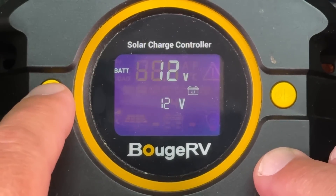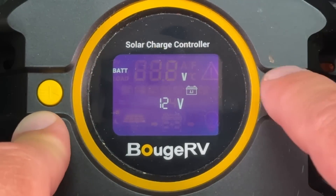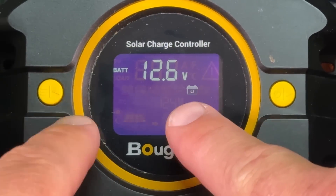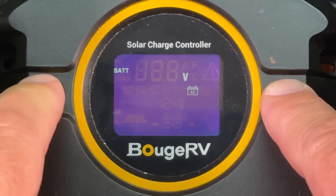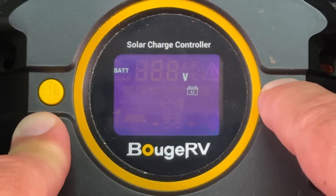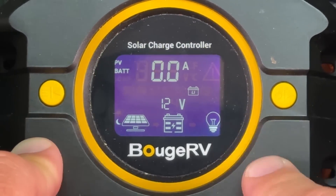Let's click the left button again — notice it's on 12 volts. If we long press the left button, that'll start blinking and we can change it to either a 12-volt or 24-volt system. We probably want 12 volts in your case. We'll hit the left button again — here's where you set your charging voltage. Because you have a three-cell Lithium-ion battery, you want to charge it to 12.6V. If it's not at 12.6, long press the left button and use the right or left arrows to set it. Then long press the right button — that's all you need to do.